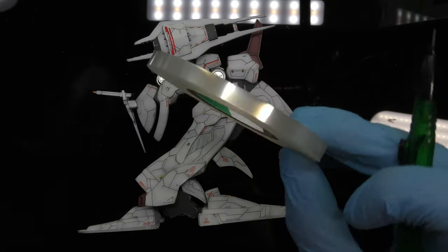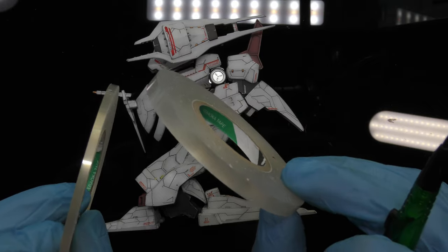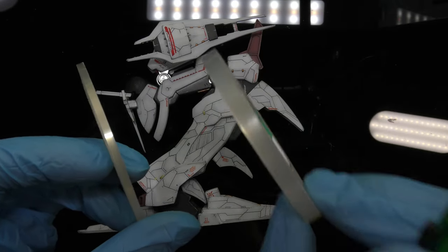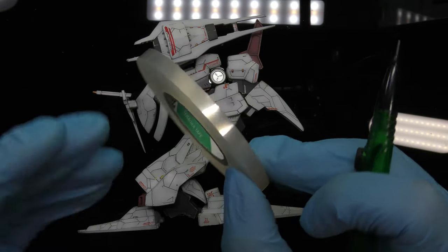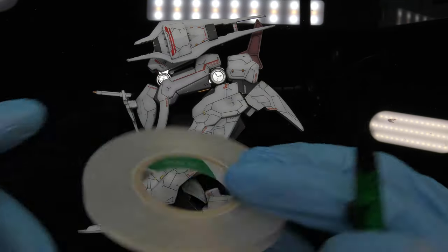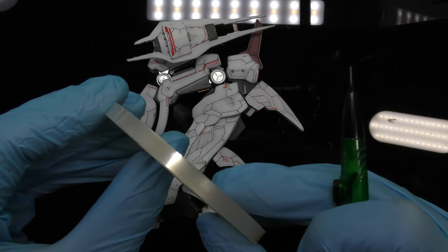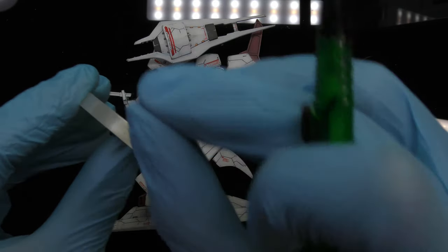By the way, this is HiQ parts, H-I-Q parts guiding tape. 3 millimeter width, 6 millimeter width. I like the 6 millimeter more because it has more tacky surface area, so it sticks for longer, it can be reapplied more times, and it's less of a liability because it doesn't shift when you use it, say, as like a stop tape for your blade.